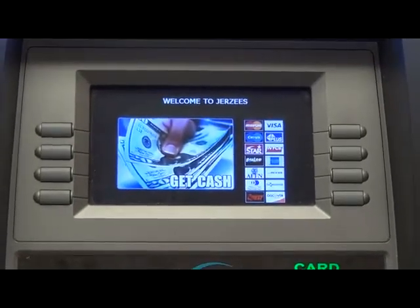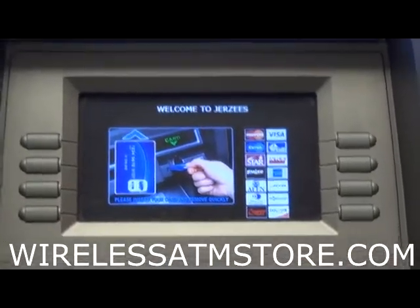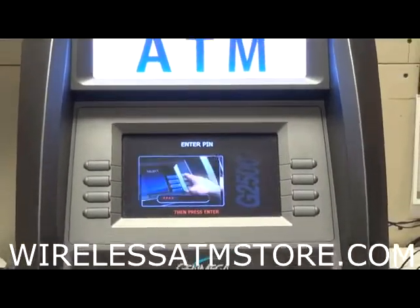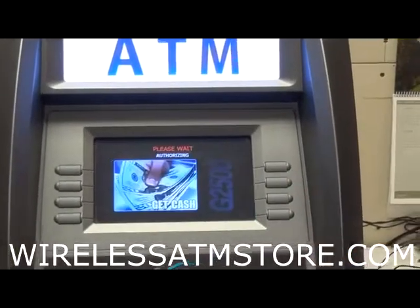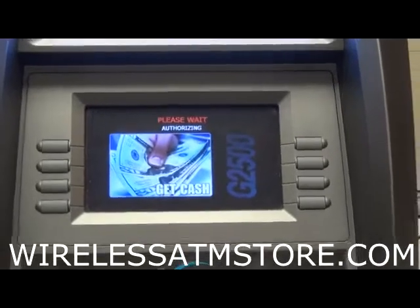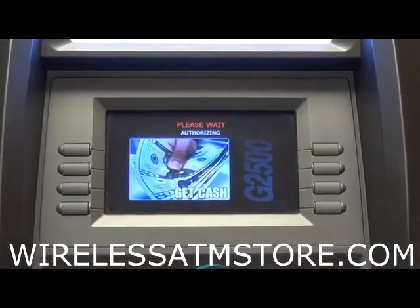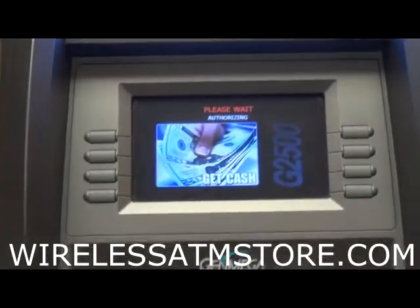Alright, so we got a call from the customer saying that there is communication issues. So first thing we're going to do is obviously test the ATM machine to see if there actually is a communication issue with the unit. So just do a bad pin, balance, yes, checking. Alright, we're authorizing. Okay, so I already know that this is going to fail out because it's taking too long. So we'll just wait for this to error out because we don't want to do our next step until the machine's done erroring out so we don't mess anything up.